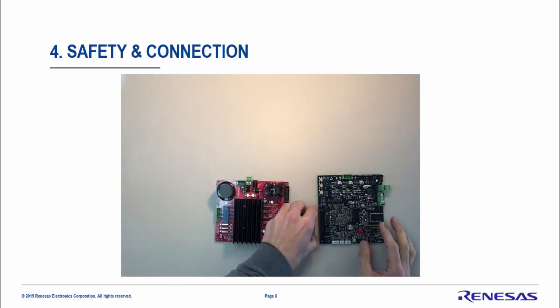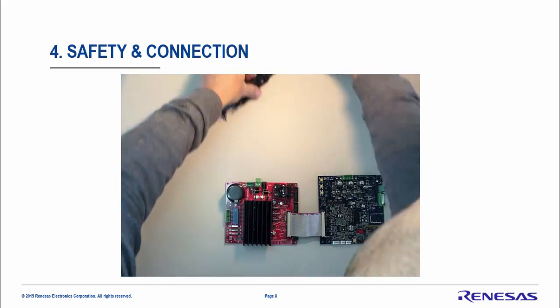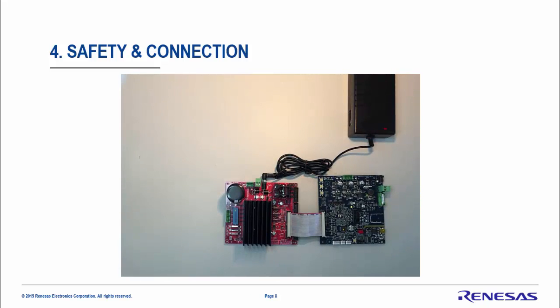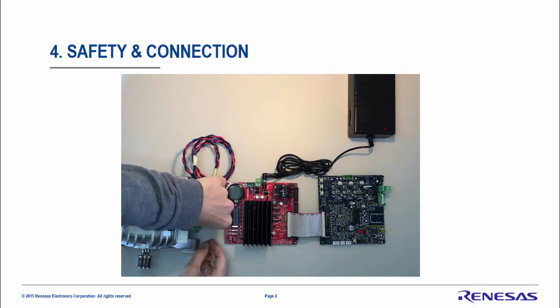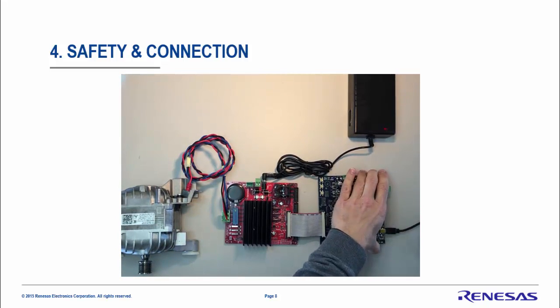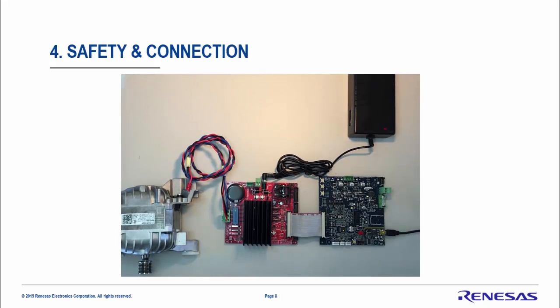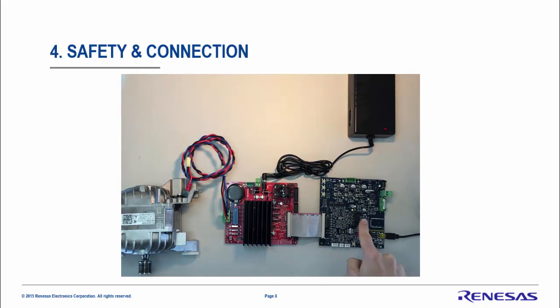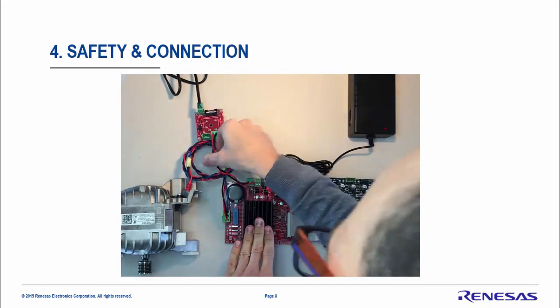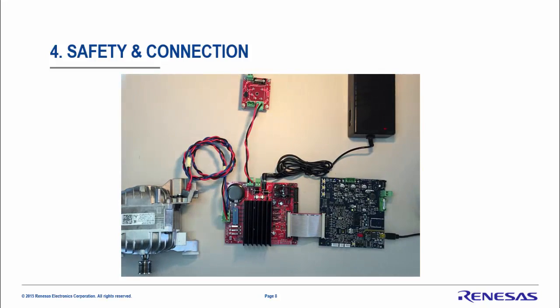By removing the jumpers we enable the connector to work correctly. We first plug the power stage and the 24 volt power supply. We will plug directly the high voltage motor — only the three phases, fully sensorless. We can connect the PC through the fully isolated USB. Finally we will connect the rectifier once the LEDs are working fine. The rectifier is directly connected to the power stage.